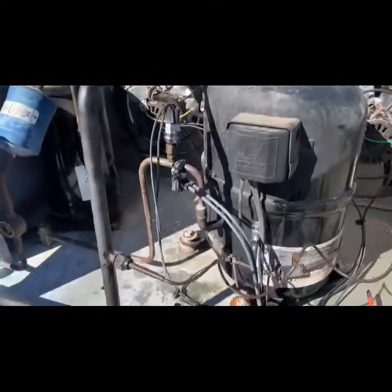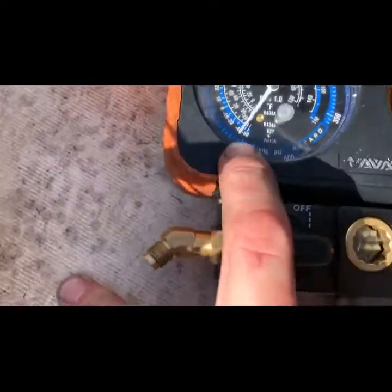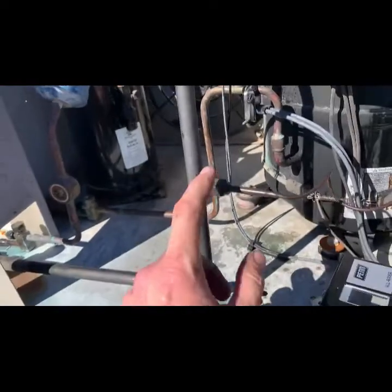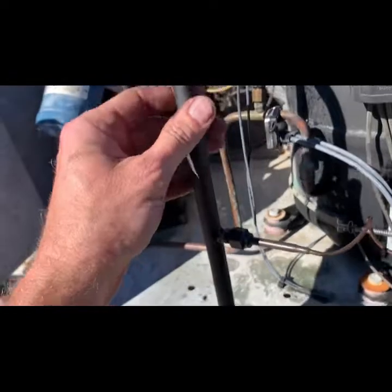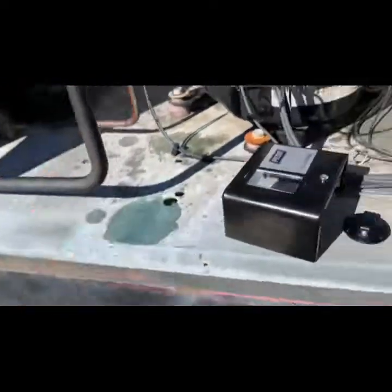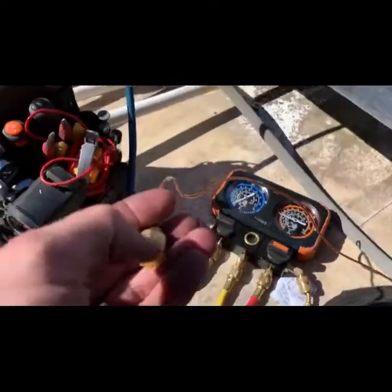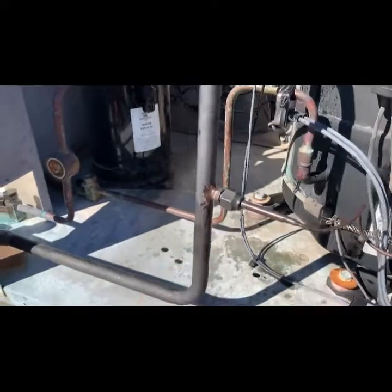She's satisfied, which means the solenoid downstairs cut off, which means our pressure is less than 10 PSI. So I'm going to be able to back that off and do a hot swap — there's less than 10 PSI, I can back that off, put my thumb on it, and put the new one on. I'll put a drop of nylog thread sealant on here first. I won't video the actual swap because I'm going to need both hands and I'm solo today.